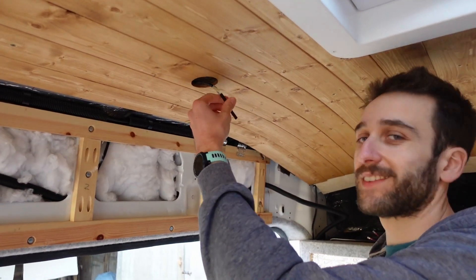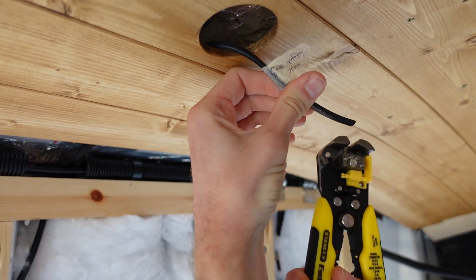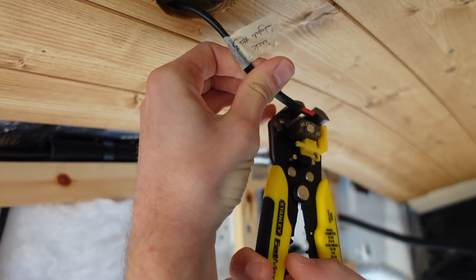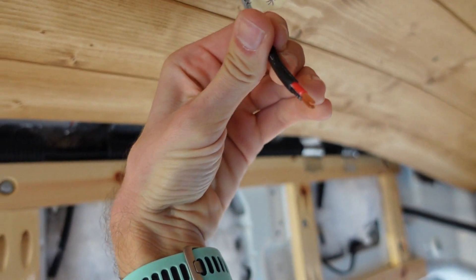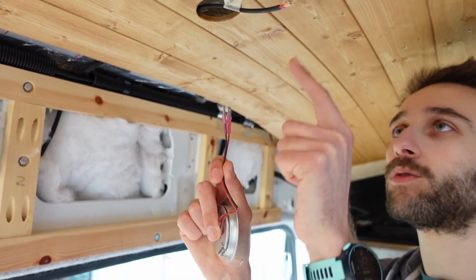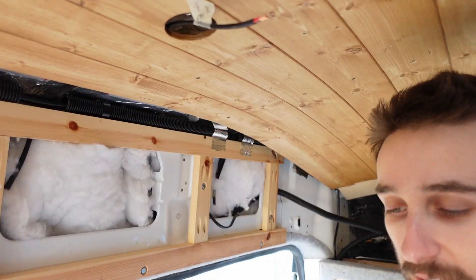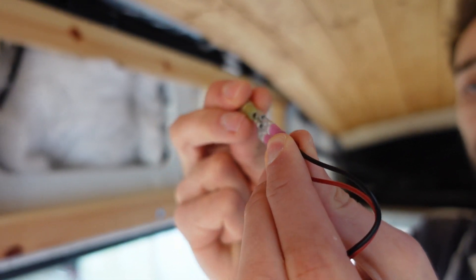Tim's taller so he's going to take over for this bit. The nice thing about these strippers is they pull off the outer insulation first to pull these two wires together, and then each wire is insulated as well, but you can just do that. So we're using the red connectors on the actual light, which is the smallest one you can get, but these are too small for the thicker three-mil wire going to the light. So we've got the yellow ones for that, which are a lot bigger, but fortunately the actual spade parts are the same size so they still connect together perfectly.